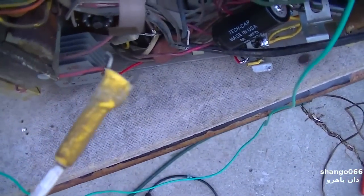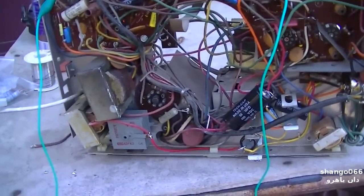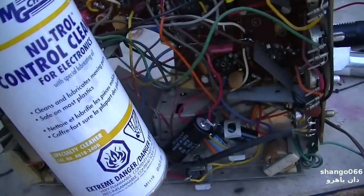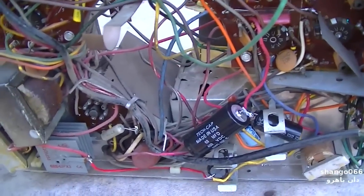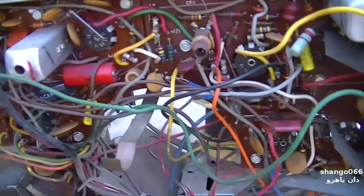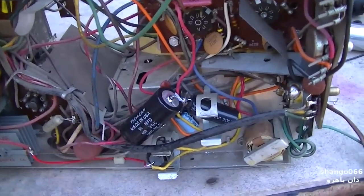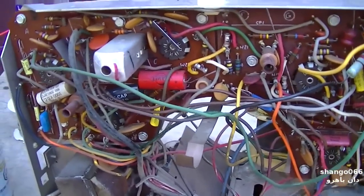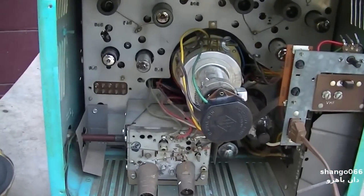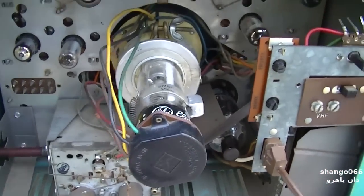High voltage and the horizontal frequency — there we go, that's a little better. There we go! Okay, we have high voltage. The flyback is working. I'm going to go ahead while I'm in here and spray all the controls. Who knows — I might put it together and it might actually work even with the wrong capacitor values. There's so much tolerance in this tube stuff. We're ready to power this up. I've inserted it back into the case, just attached a speaker — I took the speaker out and removed it so I didn't punch a hole in it.